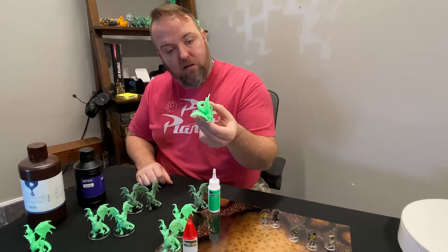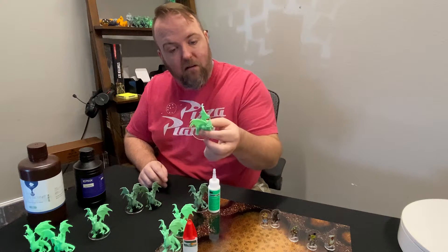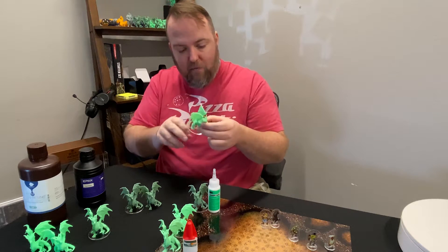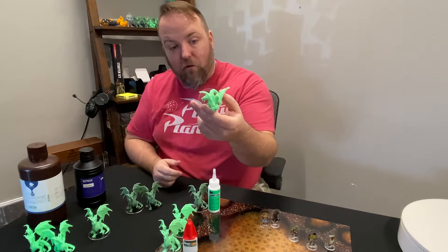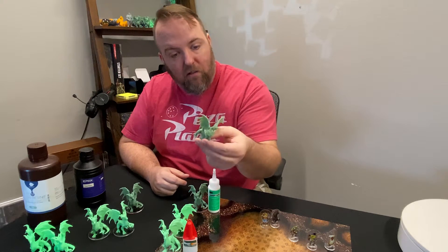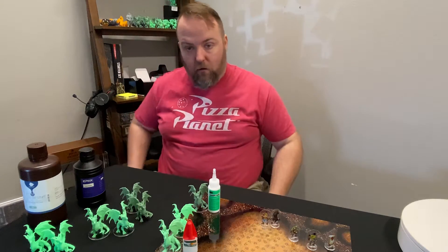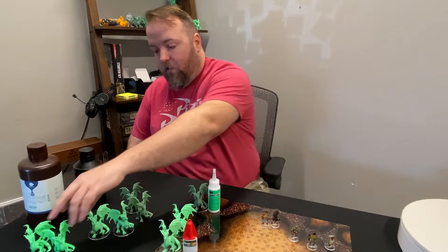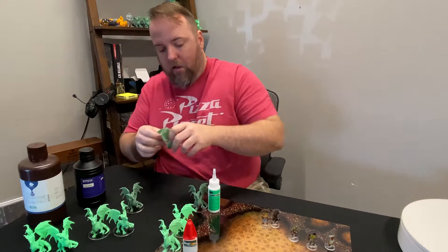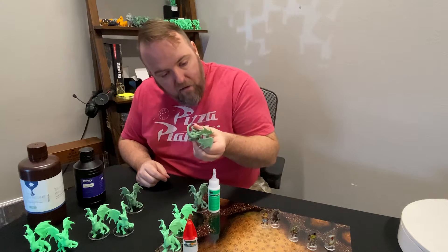This was the original green plant-based resin. After very cautiously mixing in just a little bit of black, it got a bit darker. I was expecting maybe it would have mixture issues, maybe lines, maybe problems. But after this first test worked, I knew there's no problem at all. We mixed in even more black and started getting this dark olive. The soft plant-based resin and the hard black — this one feels more like the hard resin, this one feels more like the soft resin. But they mix flawlessly.